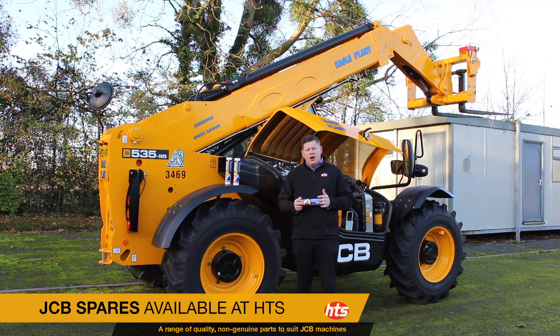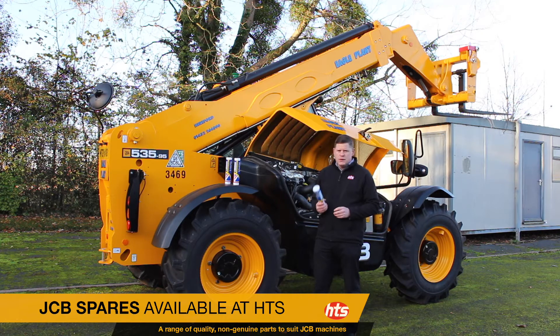Molly grease has a high resistance to friction and is also very resistant to dust and other particulates. That's why it's very good especially in excavators on a dipper arm where you're going to be coming in contact with a lot of dirt. Molly grease or pin and bush grease is the best product for that application, though obviously not applicable to this machine.